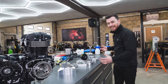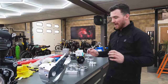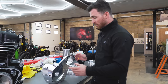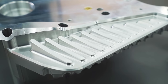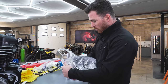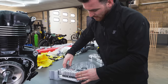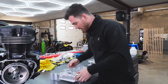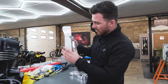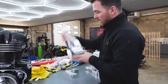Just in time for this delivery of absolutely insane parts — this is our one-of-one, custom built, completely in-house designed supercharger kit for the C30 Rotrex centrifugal supercharger unit that we're going to put on this WFB. These parts are billet aluminium, completely made out of one big lump that we've designed from scratch. We've got all of our mounts in here for the generator, and on the back we have the recess for the oil tank for the supercharger — millimeter precision fit. The supercharger is going to sit right there, with the oil tank for the supercharger held within this casing too, so we don't need a separate oil cooler because there are loads of cooling fins on there.